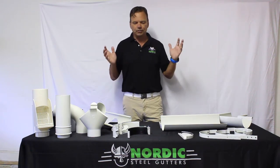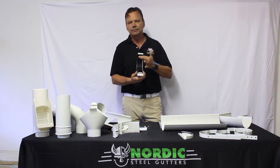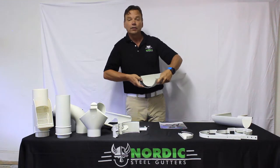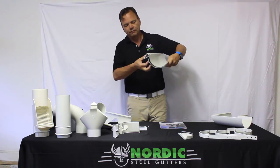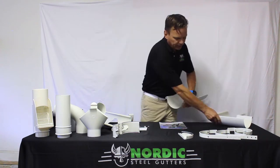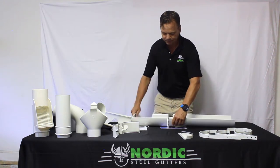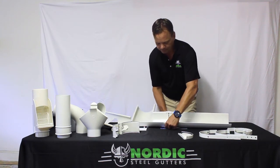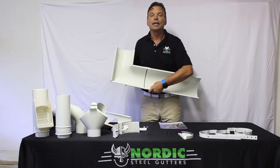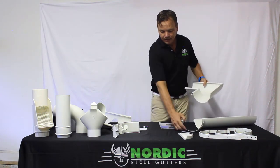Once you put your hangers up, your gutters in, and your end caps, when you want to connect them you use a gutter connector — same thing there. What makes it seal is the EPDM rubber; you don't put any caulk or anything else into it. You simply line up your gutters, connect them with the gutter connector, fold them over, close it, and lock the locking tab. You can demonstrate it with a miter — you connect your gutter and your miter with the gutter connector, close it up, and leave a little bit of gap. The EPDM rubber is black, and that allows for expansion and contraction as well.